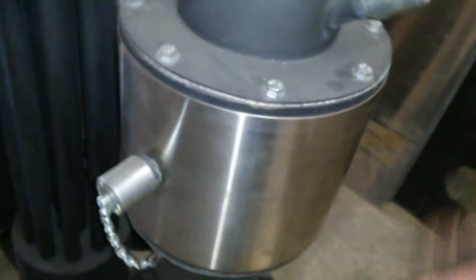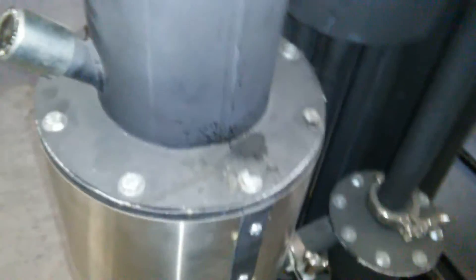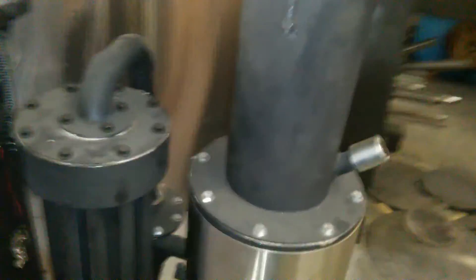On the M1, this one does not have the removable jets. If you remove this panel, it's basically a cavity for insulation, which both machines have. It's the same jet setup, but instead of removable jets it has a jacket that channels the air to the jets. If you ever had to do a jet change on this, you would have to remove the stainless steel band and also remove the hopper to access the jets. Also, this doesn't have it yet, but there's a handle that's supposed to go through here for a manual grate shake.